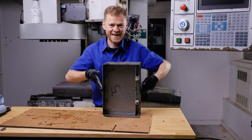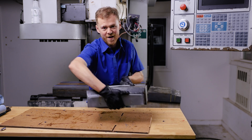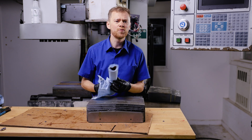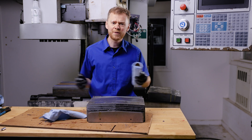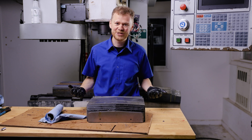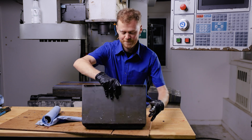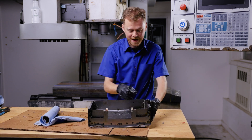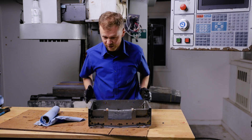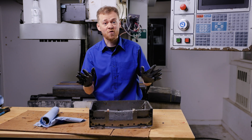Now this is a little way cover; the front is a little harder. All new wipers — it's semi clean. I know some people who power wash them; just wipe them down with a little bit of light oil and you're done. You can put a little bit of grease on the edges if you want — that kind of collects chips, so I'm on the fence about that. When you're checking them, you want to make sure you have the plastic tabs and that none of them are bent out or in — that'll cause issues when it's rolling in and out. These way covers are ready to go back on.